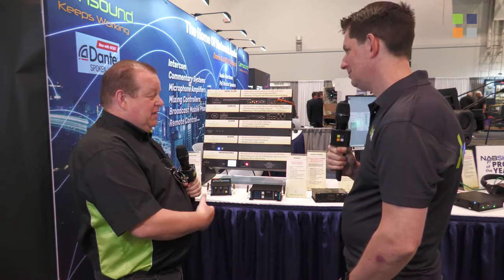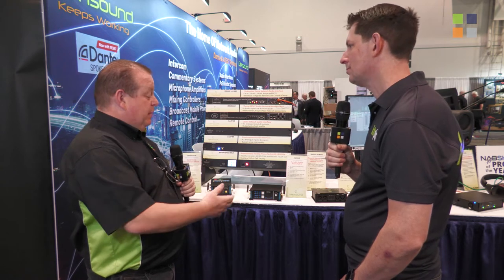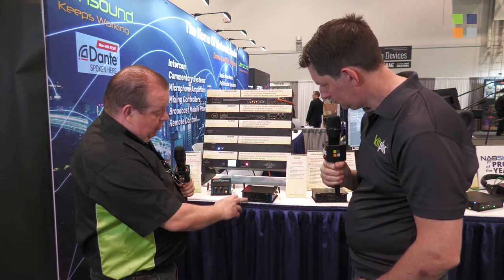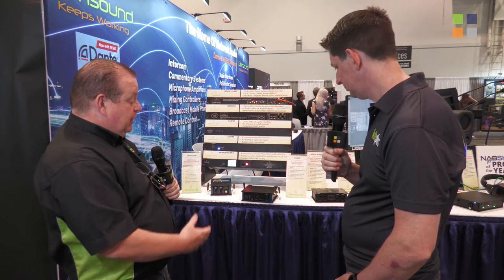It will also work in standard 3.4kHz mode on normal calls. But even on normal lines at 3.4kHz, the fact that you can plug a proper microphone into it, and we have our balancing on the system, it sounds significantly better than a telephone does. They're used a lot in radio for quick interviews, for backups. They're used as in-ear monitoring devices, and a multitude of ways the predecessors have been used over the years. We did make a change on this. There is a software control where the line out on the back can be the remote end only, as in a proper balancing unit, or the line out can be a mix of the send and the receive, if you need a mixed out, which is something that we've been asked for.